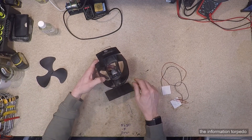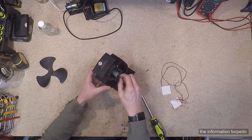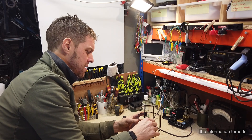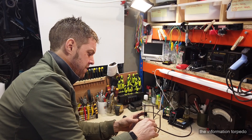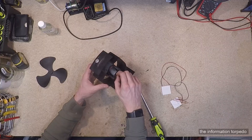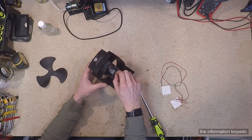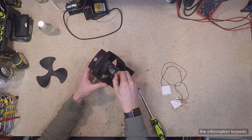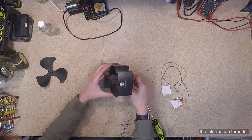Give the motor a little spin between your fingers and you can feel if it's got a knock in it. If it feels smooth and rotates nicely, it's probably all right. There's a little bit of a grind on mine — I think it needs some lubrication — but there's no knocking and no jolts. If you feel a dint as you spin it, that generally means it's knackered, but this one feels fine.